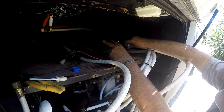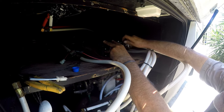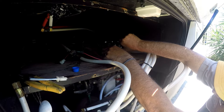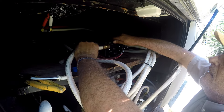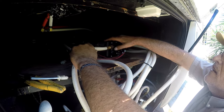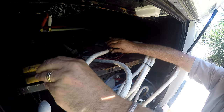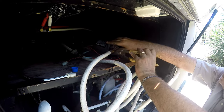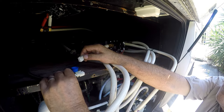We have the inflow and the outflow, so let's get them in. I'll do the outflow first. By the way, these only have to be hand tightened — but very well. Then we're ready for the inflow. Make sure you don't cross the thread on these, especially with this brass fitting — it could easily happen and that's the last thing we want. Because this is a brass fitting, there's no way to hand tighten this so I have to use the pliers, but I'll be very gentle.